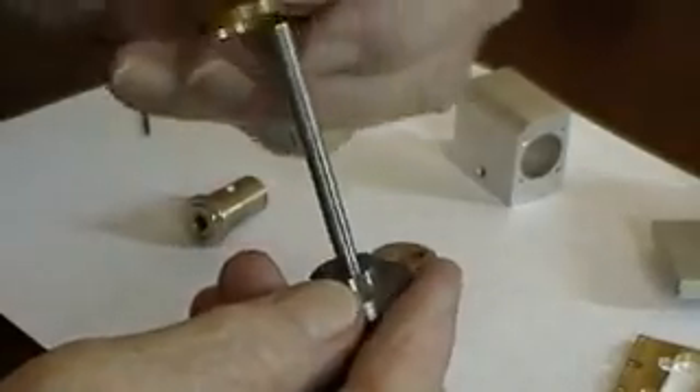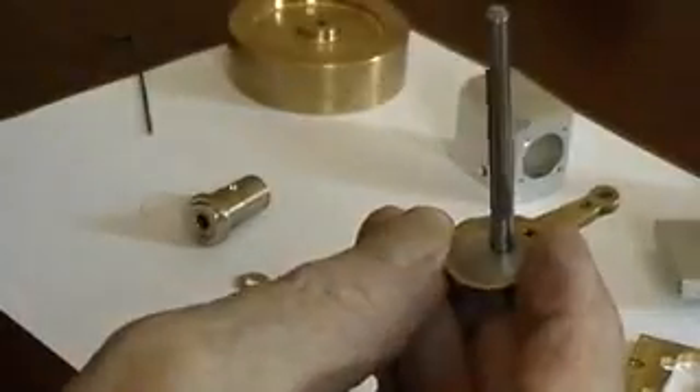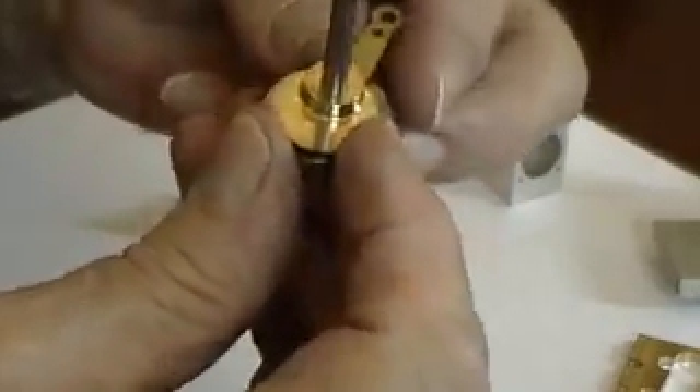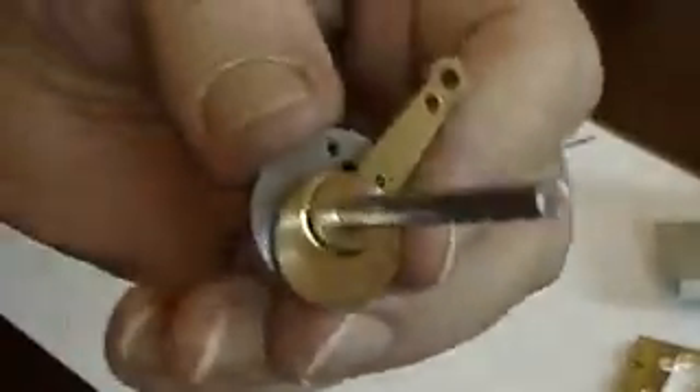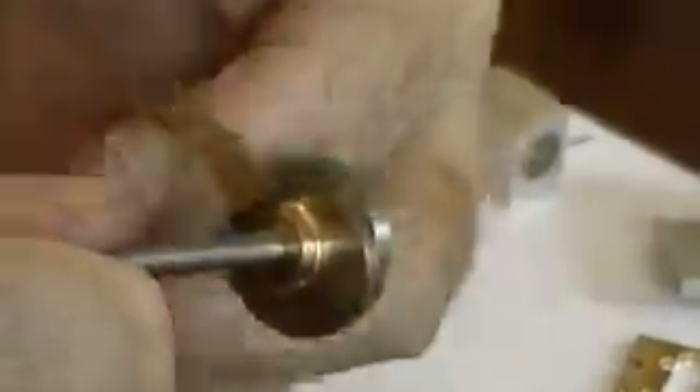In order to keep the arm in place, I did a little bit more eccentric machining. This is simply a little eccentric flat plate which sits over the shaft. When it's aligned properly it holds everything in place — I'm going to align it and show it to you. It is assembled. There — it can't come loose.